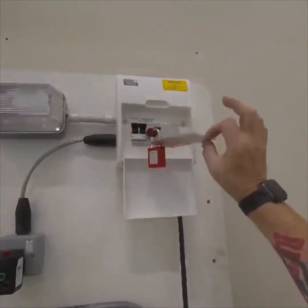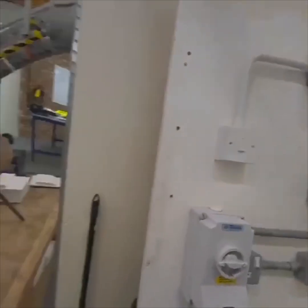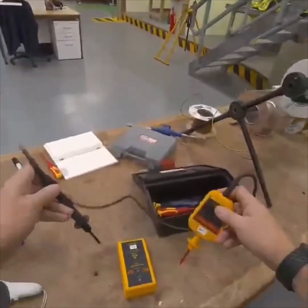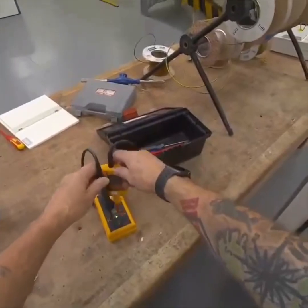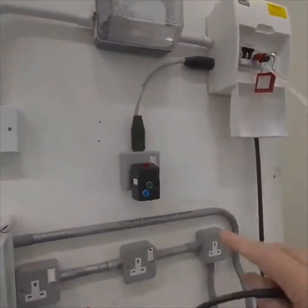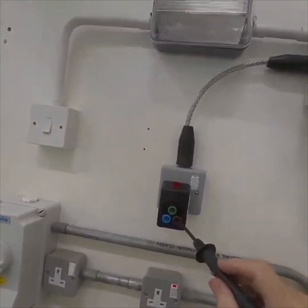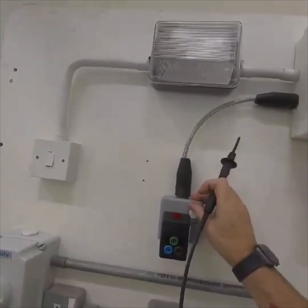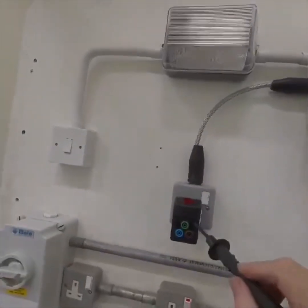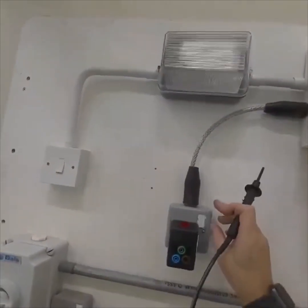The key goes into my pocket. I haven't put any contact information on the label for today, but if you were working down the corridor you would put your contact details on it as well. I can see the circuit has gone off, but I still have to prove it's de-energized. So with my test instrument — yes, I can see it's working — I can identify the three terminations. I also make sure the socket itself is in the on position, because if it's in the off position I'm not actually proving it's de-energized, only that it's turned off.